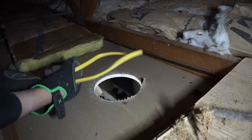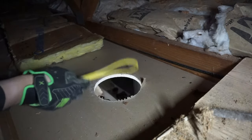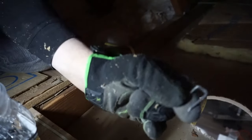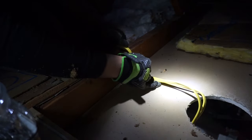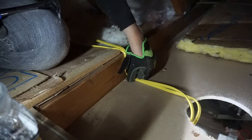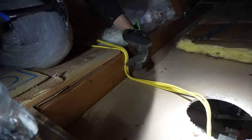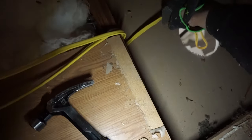After putting the wire through the hole, take your staples and neatly staple it to the joist. Don't over-pinch the wire because that can cause damage — just enough to hold it in place but not too tight. The wire is looped through the first hole with enough line to connect to the main power source J-box, and the wire from the spool continues on to the next holes.